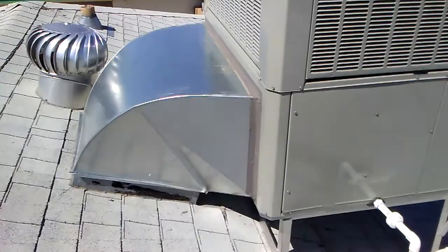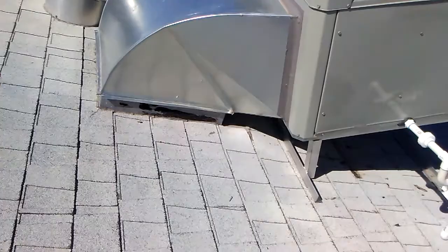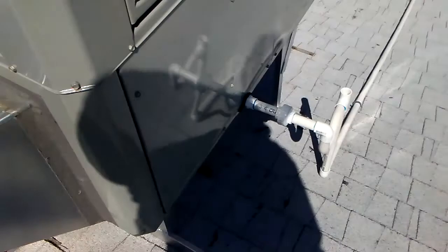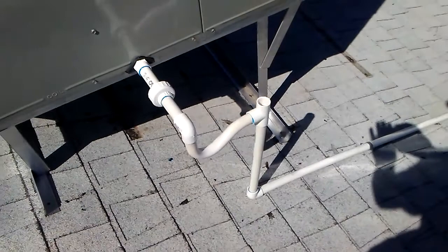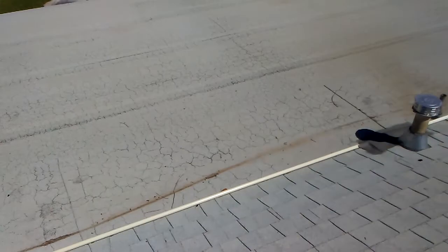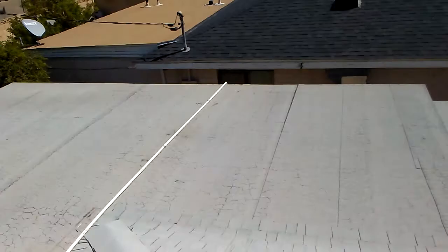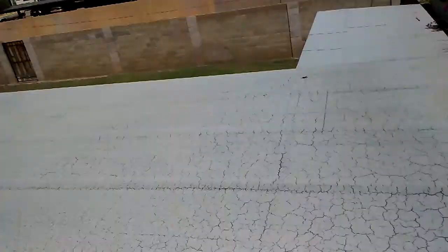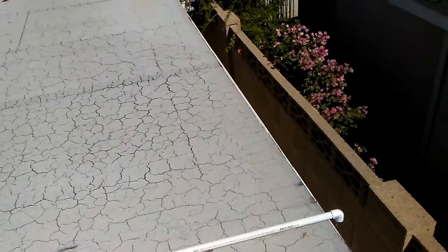You can see all of the joints between this sheet metal elbow and the unit are sealed very nicely, even underneath. We put a union in this drain line so that you could take it apart and clean the drain line out real easily. And we ended up piping that drain line way over there so that it drains in a place that is convenient for the homeowner — less problematic than having it terminate in the backyard by the patio.